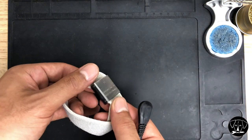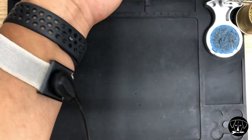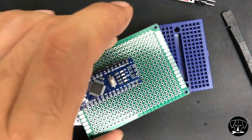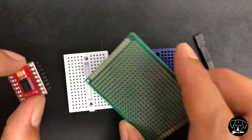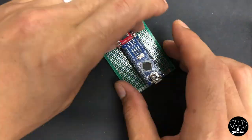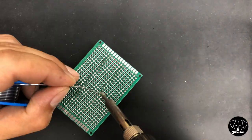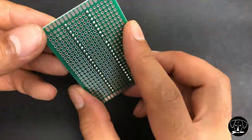Usually when working with electronics, it's always a good habit to wear an ESD safety strap and to ground yourself to avoid damaging a component with electrostatic discharge. To control the motor, I'll be using an Arduino Nano for the logic and a TB6612 full bridge to drive the motor. I mostly chose this driver for its size and current output, which can peak at 3.2 amps. I'm using headers so that in the future, if the component fails, it will be easy to replace. If you want to learn more about Arduino, I'd suggest checking out the Dronebot Workshop channel — he explains everything from beginner to advanced in a very easy-to-understand way. I usually like to design my own PCBs using EasyEDA and ordering them through JLCPCB, but this time I'll just use a cheap prototype PCB board.